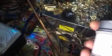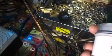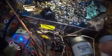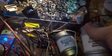So four of those. Take that 3300 divided by 4, half's 1.6, half of that's 800. That's 800 PF as a final stage. That's then 4 times 16, so you're 64,000 volts rated as a collector. So that would be what would swap there. And in theory, you could probably put multiple leads, 3 or 4 of these wired up through there on both sides. We'll have to see what just the one collector takes.